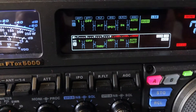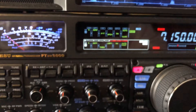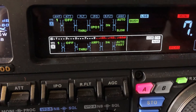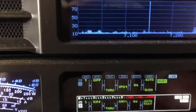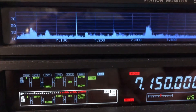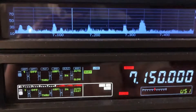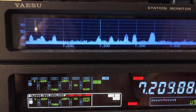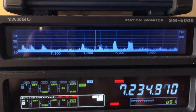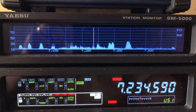I did have IPO on, if you'll notice — IPO is engaged. You don't need all that extra amplification on the front end of the receiver when you're down on these lower bands. You can see where if the microtuner is engaged, you see that little micro symbol T? There's bypassing it. Let me turn off IPO — look at the noise floor. It's a high-Q pre-selector. Watch the band edges — let me just center it up a little bit more on the band. When I engage it, you see how it slopes off on the left and right?